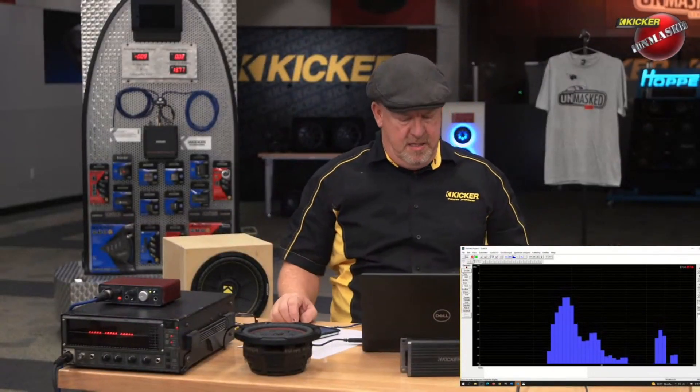So, building boxes — what are my suggestions? There's no right or wrong; take anything you want away from this. I always recommend a separate chamber for woofers, especially in a sealed box. If the woofers are exactly the same and they always play — meaning one doesn't come unhooked or you don't blow one — they're going to be pretty close to the same output. One difference you might notice without the divider is cabinet resonances if you don't have bracing, as the cabinet actually vibrates.